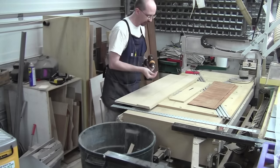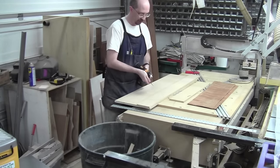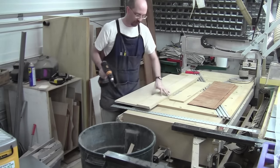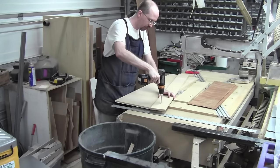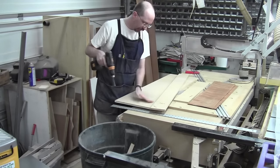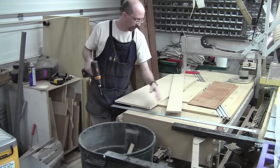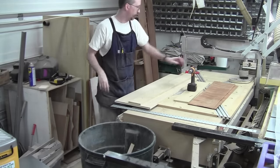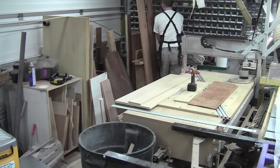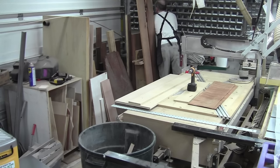Okay, I'm going to flip this over, and we'll only drill this piece. And chamfer this one just a tiny bit. That way, when the screw goes in, it doesn't mushroom and mess with me. So now, go get a screwdriver, and some screws that I hope are long enough and also not too long. I'm not sure which just yet.